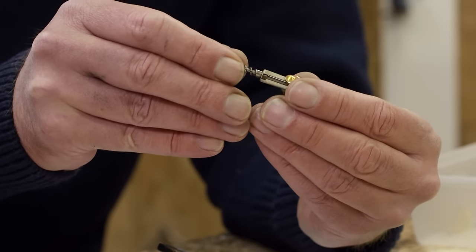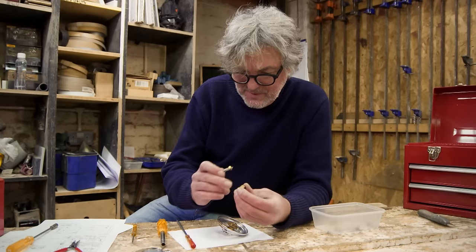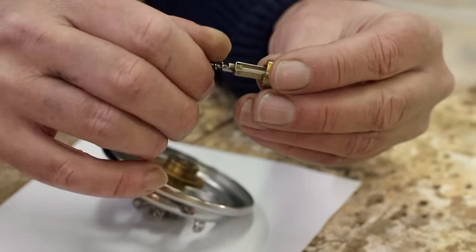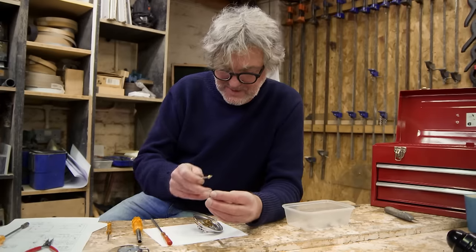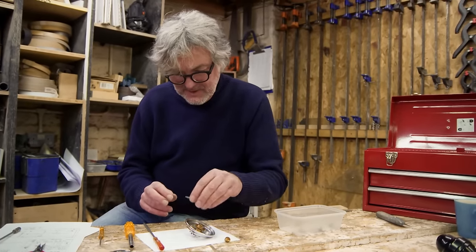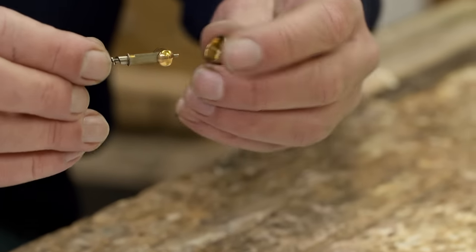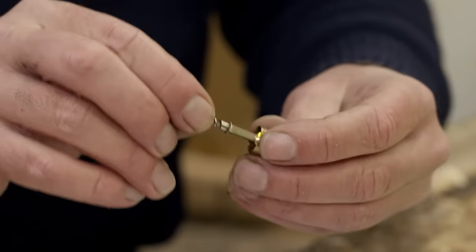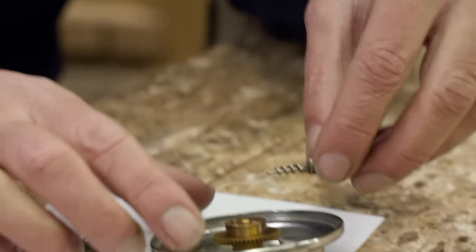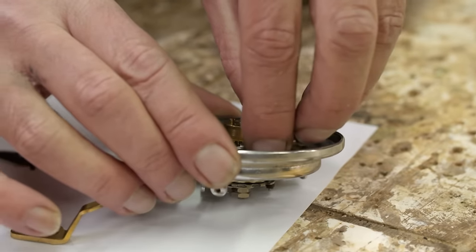It's going to slow down the dial as it goes back, because that will spin very, very quickly. Those two weights will be thrown out and will rub on the inside of that little cylinder. And that will retard, I imagine, the return of the dial. We would take the governor and the governor, I don't know what you actually call that, I'm going to call it the governor pot, and offer that up to the bearing. Offer it up is one of those things you see in old instruction manuals and technical books.